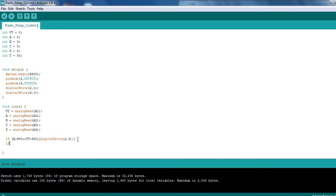Come the next one down, this is for turning that one off, so we'll do the same again. So this time it'll be if B is more than 900 and VT is more than 900, then we'll digital write, I'll find my keys, digital write 2, and we'll be setting that high to switch that one off.